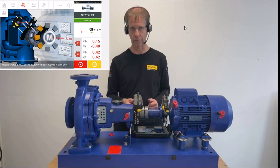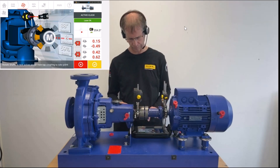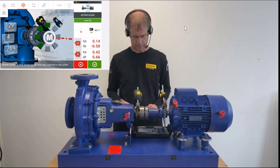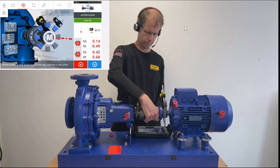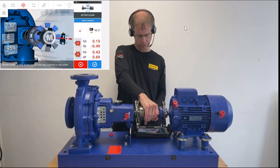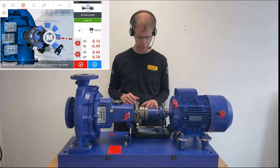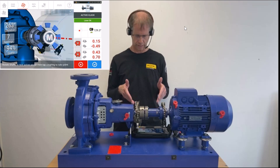We could call a result already, but as we have still a way to go, we proceed with the measurement to 12 o'clock. The M is showing, so I press the M — we have passed 90 degrees now, so we are green already with the color of the fan. I take the 1:30 position and hit the M, then proceed to 3 o'clock and press the M. I take a last position at 4:30 and hit the M again. I can't proceed any further without the rods or sensors touching anything, so I stop here.